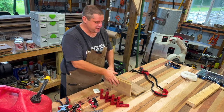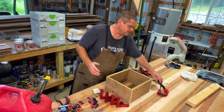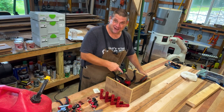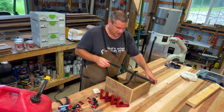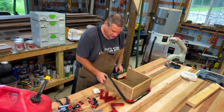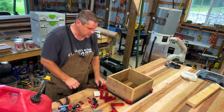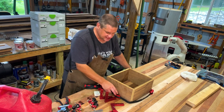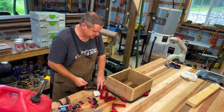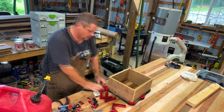I've got four pieces of plywood here. I'm going to place them in a box and surround it with these clamps. There's the first problem — I knocked over a piece already. This is a reoccurring problem with these clamps. The idea is that you secure your piece by putting each one of these 90-degree angles on each corner of your box. Once you have it aligned, you tighten your rope — and there's another problem: the ropes slip consistently. I'll try to tighten this up and as you can see, these corners are slipping. Once I get it fairly tight, I'll lock down the clamp.